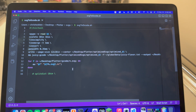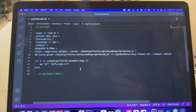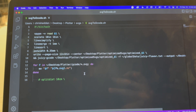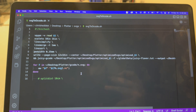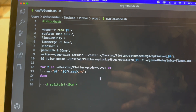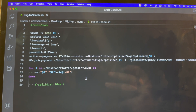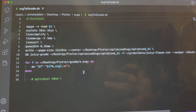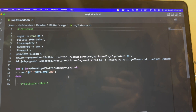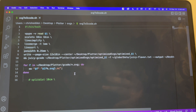This is the code that I use to optimize all of the SVGs and make them the right page size for the plotter to draw. I use VPype, as you can see. I highly recommend VPype — it has so many options and it makes everything so much easier. I just have it scaling to the right size, simplifying the lines, merging any lines that are right next to each other, sorting them to make it more efficient so the pen doesn't lift up as much. You can set the pen width as well, then write it to the correct size and save it wherever you want. I'll probably have this code in the description, but I recommend looking through the VPype documentation and making something that works well for you.